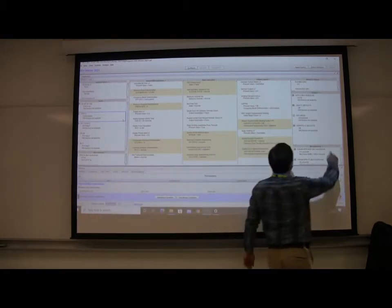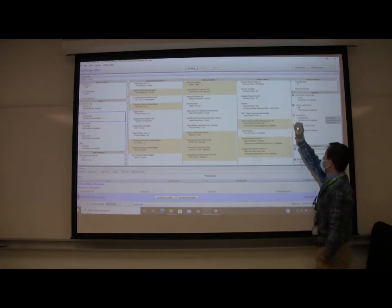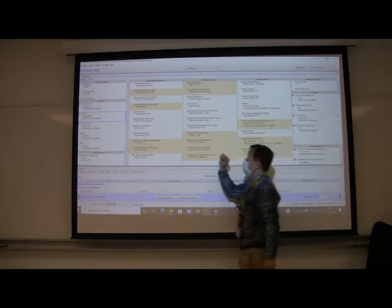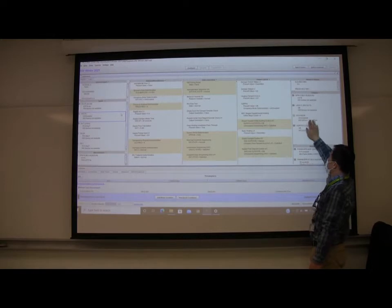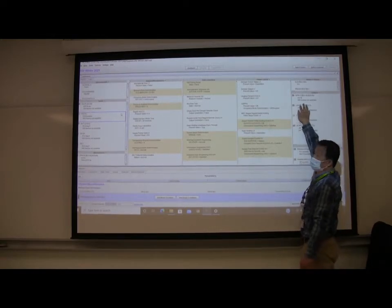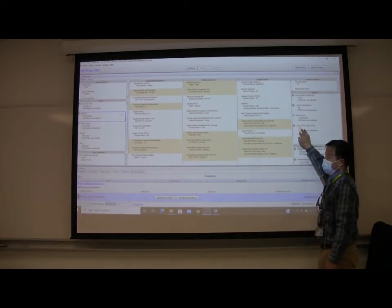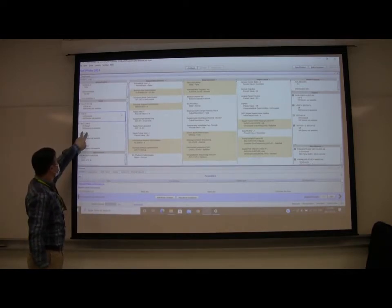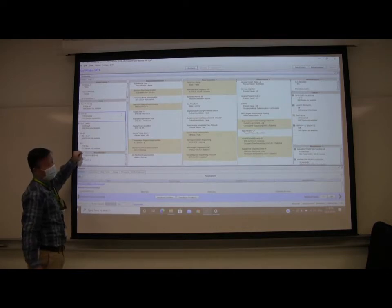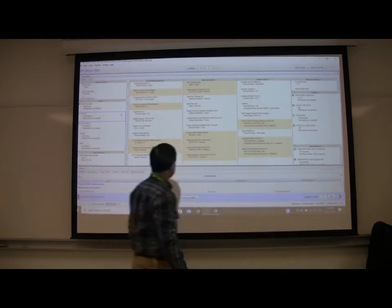This side is input. Here, this is the output. Because the system is off, the damper is closed. And because the occupancy sensor is unoccupied, the occupancy mode output is unoccupied, and the lighting is off. The heating is also off, because the zone set point is 72 and the zone temperature is 72. They are the same, so the heating source is off. Now we simulate.